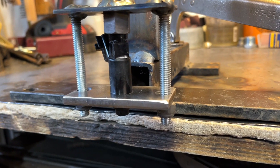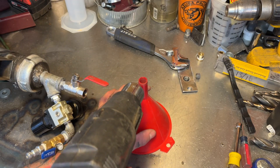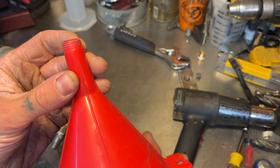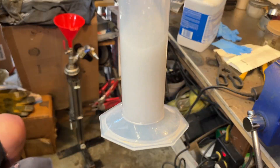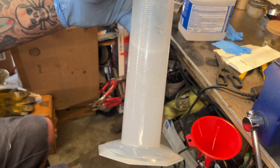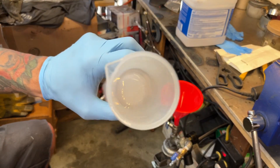Now we need to figure out a way to get our fluid into the cylinder from this ball valve. We're going to use a cheap plastic funnel - they're like a dollar. I don't want to hold the funnel with one hand and pour with the other, so I'm going to try to thread it on there. I'll apply a little bit of heat to soften the plastic and as I thread it in and push it on, it should cut new threads. Sort of worked - hopefully it won't leak. Now our build is complete. The crucial step is we need to clean this thing, so we'll run some mineral spirits through, shake it around, and blow it out - probably do that a few times until we get no debris. It was a little milky and cloudy, but after a couple more passes it looks pretty good - no debris.